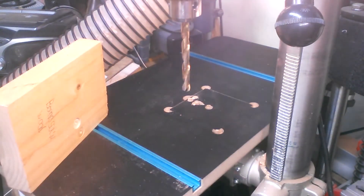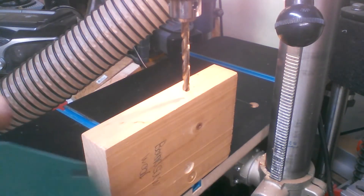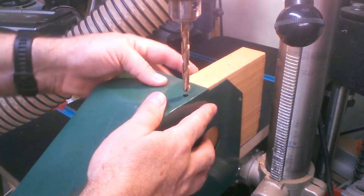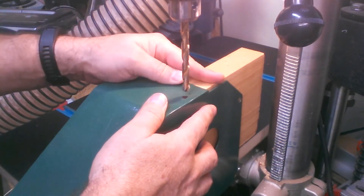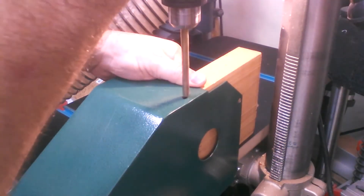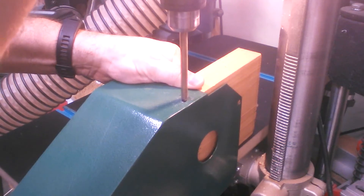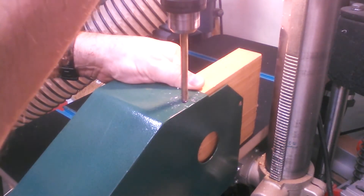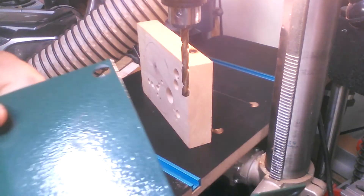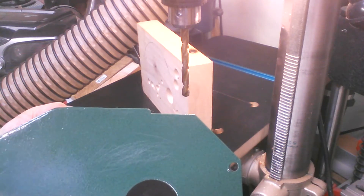What I've done is rotated my drill press table so I'm just at the very edge of it. I'm going to use this block as a stabilizer for this piece - it'll fit right up on here. I can slide this right into place so that I can drill this hole. There's the drilled hole. I'm just going to clean that up with a file now to remove the burr. Now I've got to drill my holes over here, but first I've got to go measure for that.